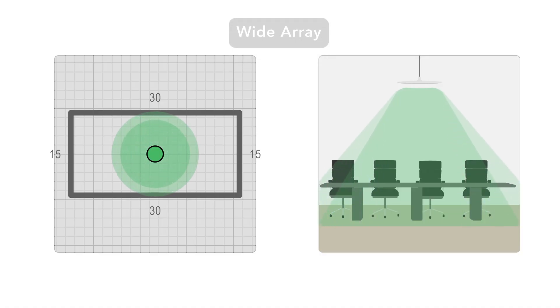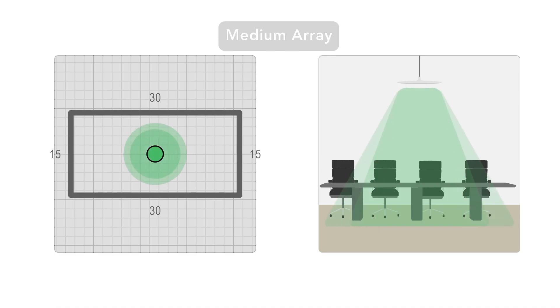The ceiling array can cover in three different beams. The first beam is what we call wide, which is 60 degrees, designed for rooms with decent acoustics where you want to cover the most space with as few products as possible. The second is medium, a 20-degree angle, designed for rooms that are more reverberant where you'd set more devices and use medium to cover less of that reverberance.